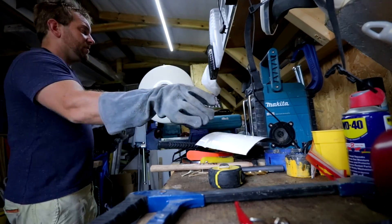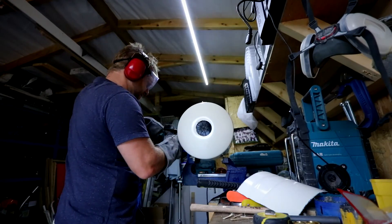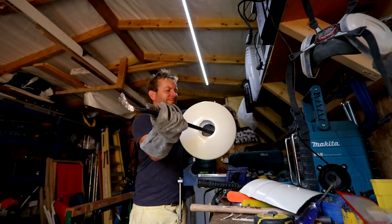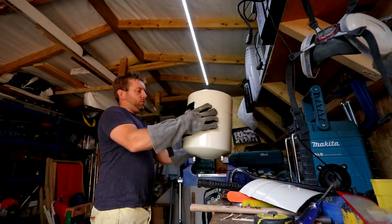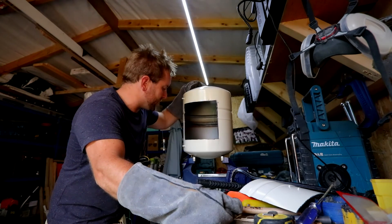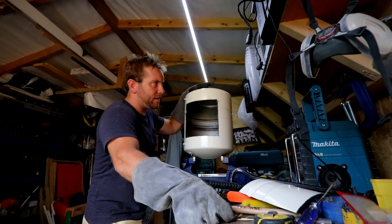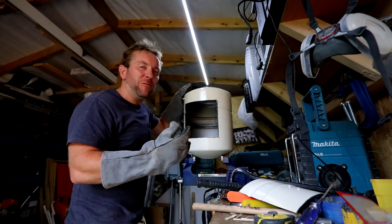That's got to be 2 mil. We've got to get this metal rim out, get that cut through, and then hopefully all that lot will pull out and we'll have our stovepipe out the top. I'm just not sure whether this is going to be able to take the actual amperage I'm going to be putting in. I'm pretty sure I'll have to do this with the MIG welder, not the arc welder - the arc welder's going to be too much, it'll just blow holes in it.